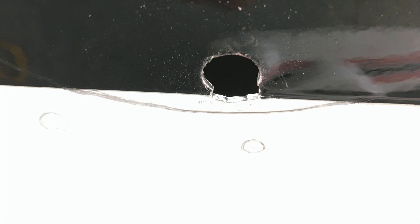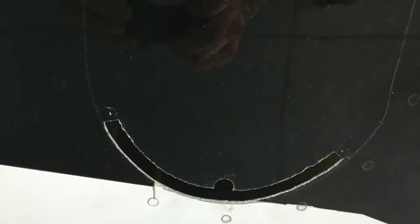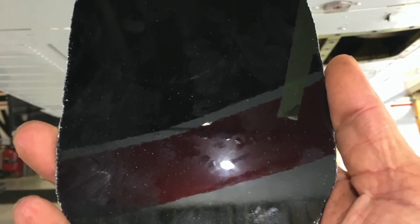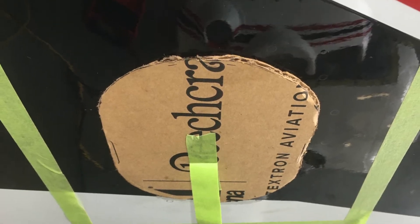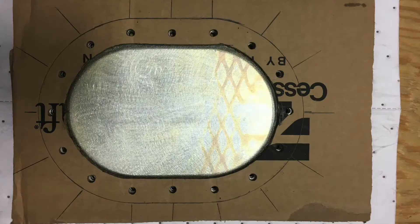I used a pencil because I wanted a really thin line so I can get it close to perfect. To cut, I start with a hole big enough to fit the nibbler into, and I use a nibbler because it gives me the closest, cleanest cut I can get. I did not go right on the line — you can't put metal back, so I'd rather cut it just a hair shy and then shave or file it. You'll see I do have to clean up the hole a little bit, but that's okay because I can take metal off but I can't put it back easily. And there you can see the pipes we needed to gain access to — I'm just trying to fit the whole piece I cut out, and you could see it was a little bit bigger.